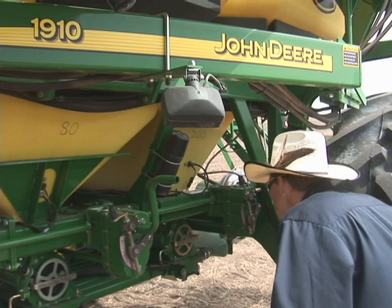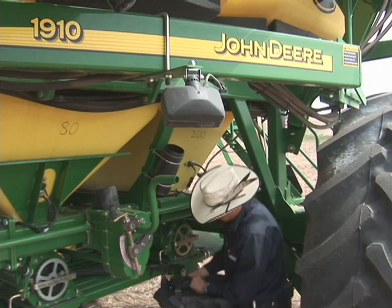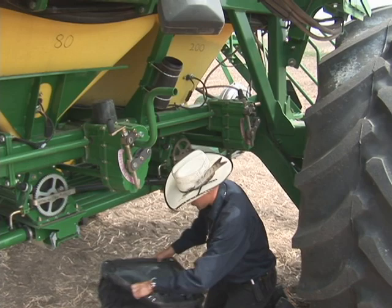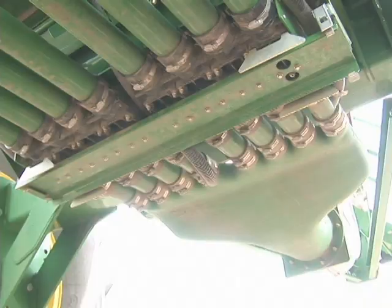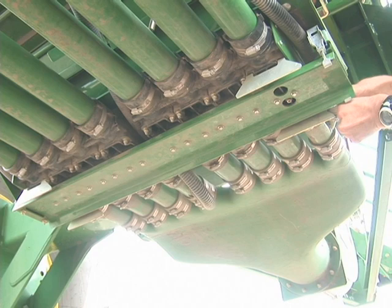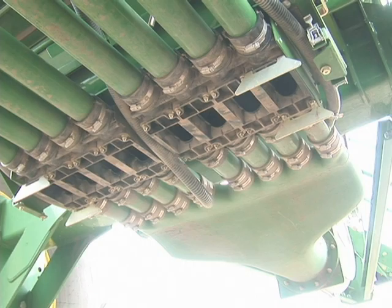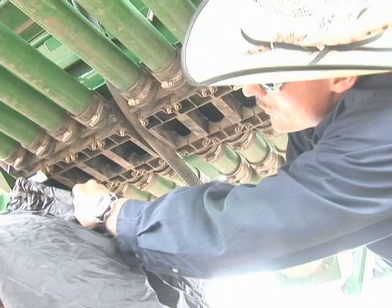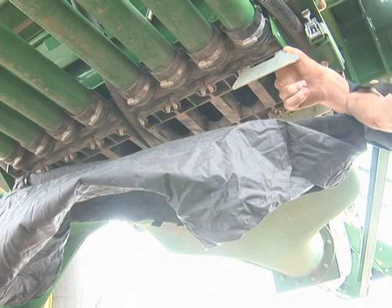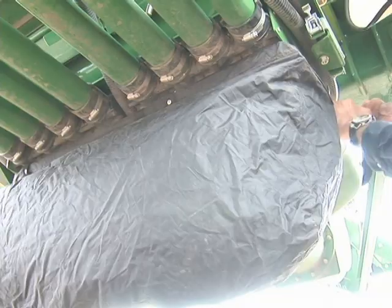The lids unscrew and the bag is all folded up inside. Verify that the bag is indeed empty — there's no material inside the bag. There are little poles in the end. Push in on the clip and up on the top of the bottom door, push down and up, and it pops down. Swing the arms out of the way and drop down the door on the bottom. Take the bag and, with the help of the built-in poles inside the bag, hook it tight onto the lips — make sure it's deep up onto the lips. Pull on the strap if it's on the corner, get the bag as high as you can, tug on it a little, make sure it's taut, and make sure nothing is hanging inside and that it covers the openings.